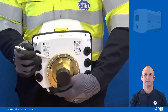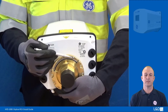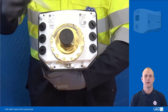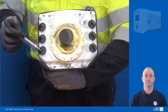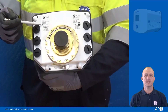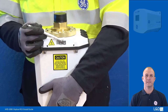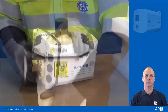Securing the sensor into the base plate is the sensor securing ring with the addition of a small grub screw to prevent the ring from loosening during operation. On the left and right hand sides are six conduit port blanking plugs. These can be removed to install cables and conduit to connect to the unit for online monitoring. On the unit base plate you should find the system configuration label — this tells the customer if any additional inputs or outputs are included and the onboard communication type. On the base of the unit is the earthing bond point; all units must be earthed when installed onto the transformer.